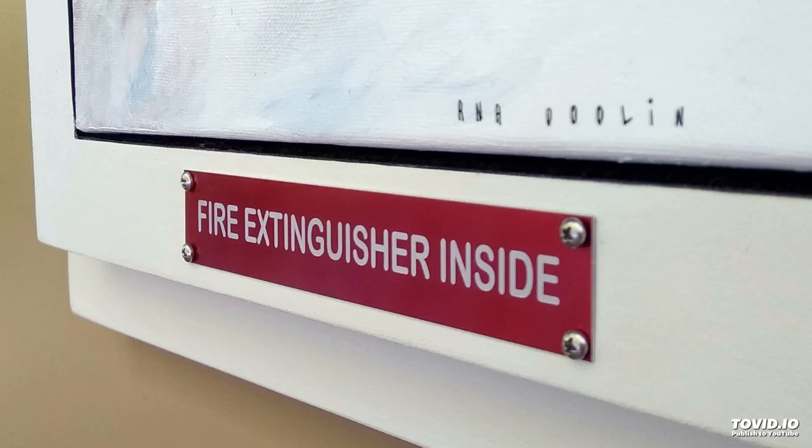But we'll now repeat the last two steps in the lower area of where the opening will be to both double check the location of the studs and also give us 2 more marks to help us place the template, which will correctly help us trace out the opening location. These extra marks help us visualize exactly where the studs are located. Again, though, remember before this next step that the frame extends almost 2 inches above, below, and on both sides of the hole that you'll soon be cutting.